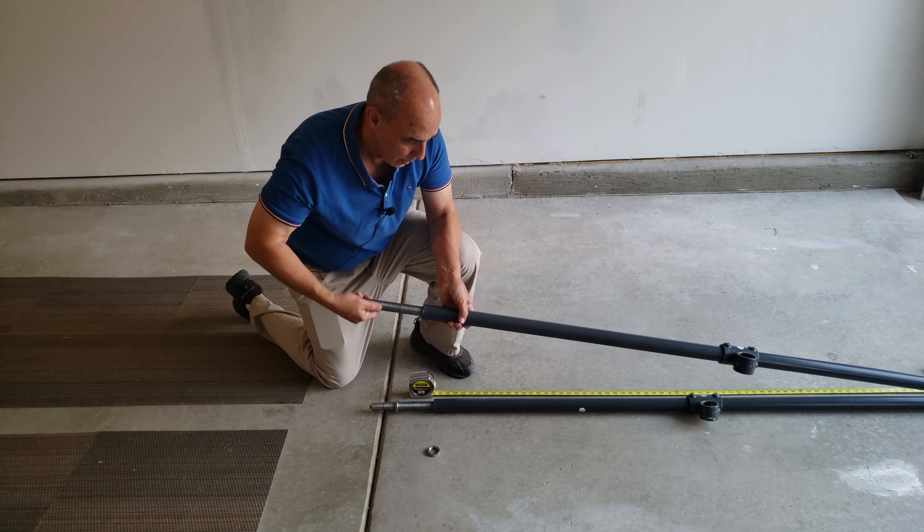We have the bolt in — don't forget to put the nut on, which you'd go back up and tighten everything once in place. These are all hand-tightened for now; this is just semi-tightened. Everything is hanging there and the more it hangs the more it plumbs up — it'll be straight up and down, which is nice. You can see how far off my bottom plate was — you have to line it up, get it right about there, and let it plumb up.